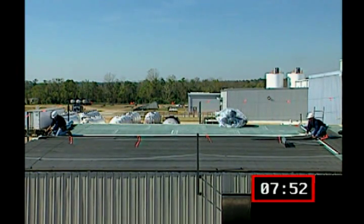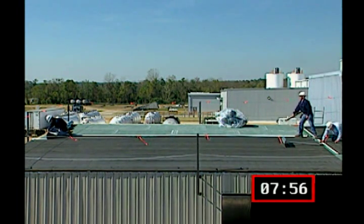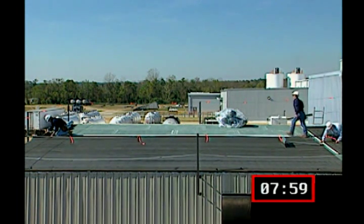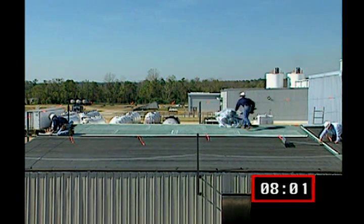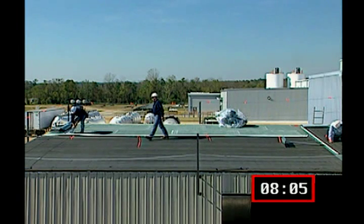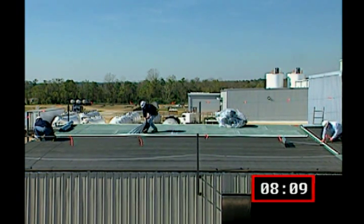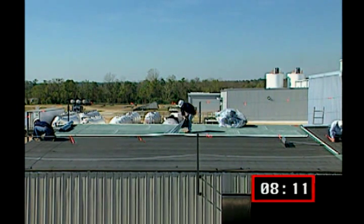The nature of the proprietary Siplast SBS modified bitumen blend results in a sheet that is softer than most self-adhesive products, making it easier to press into place than stiffer, boardy sheets, especially in cooler temperatures. The backside of the sheet is lined with a high-strength plastic release film.